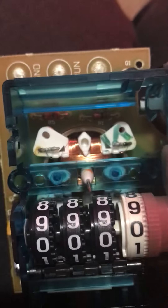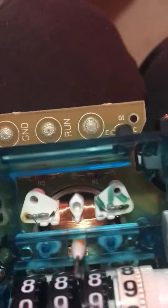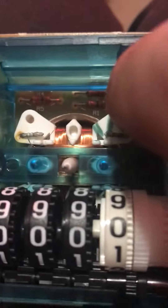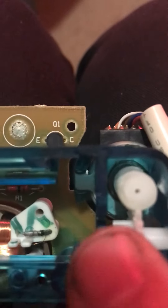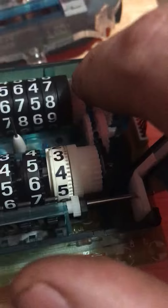Make sure those gears line up, then take your finger or thumb right there on the black section or over the gear and just push down hard. When you do that it's going to line the numbers up across the bottom bar and across the upper bar. When you've got it in, check your gear space — make sure your gears are lined up. You can do that by taking your finger and rocking the gear back and forth. See how it's moving? That means it's in.